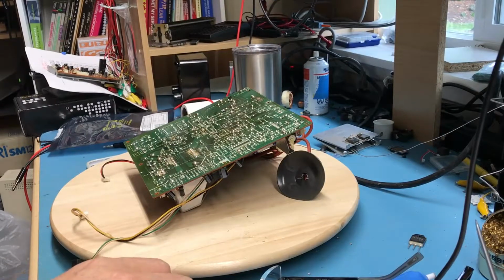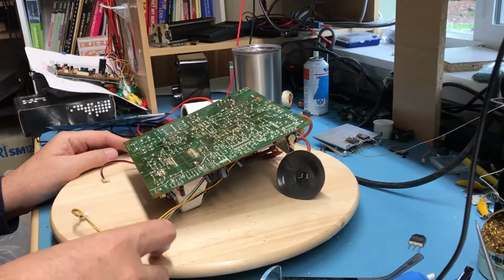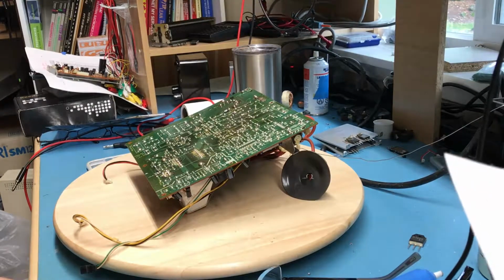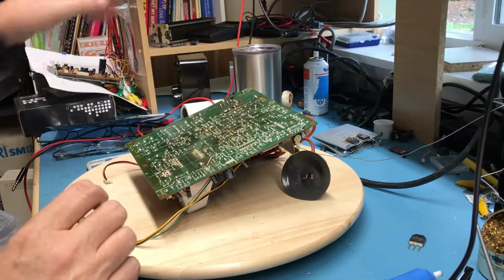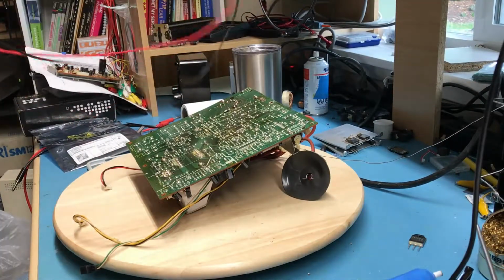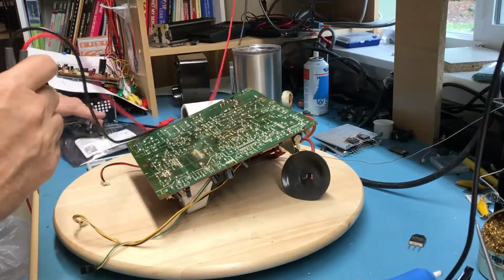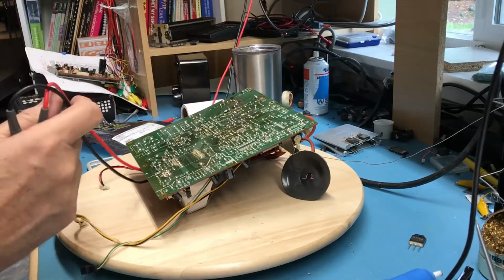Well, sorry about the phone call there. I just spent a few minutes and dug through a lot of my reclaim stuff, seeing if I could find an equivalent transistor to that D1398, and I don't believe I have anything here that'll work. But before I actually go off and order it, I'm going to keep poking through the other semiconductors here, deeper into this supply, and see if anything else pops up that needs to be replaced before I actually place the order.